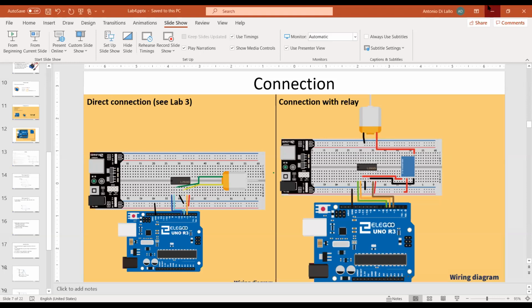Yeah, but if you have more steps, then you need to change the delay time between each step so that the total time is equal to 3 seconds. For example, if you have 4 steps, then you have three delay times, then you need to wait 1 second for each step.